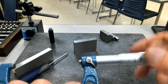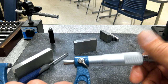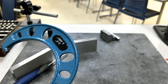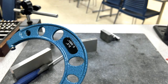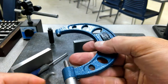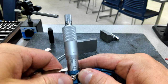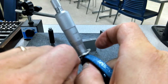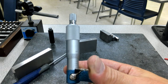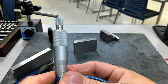Now, if I were to be consistently off by 1 to 2 thousandths of an inch, wherever I happen to be in my range of travel, so if I measure it with the standard and it's 2 inches, 1 thou, I go out to the end of my travel and I get 3 inches, 1 thou, I've got this hole back here. What it allows me to do is make some adjustments, but that is an adjustment that follows through everywhere. Ours was good at 2 inches at the beginning, and that standard fit good. At 3 inches, it was off a couple of ten-thousandths. So we have the ability to just rotate this if our reading is consistent. If I was consistently off by 1 to 2 thousandths of an inch, I can make that adjustment here with this tool, because this sleeve is just on there. It's not threading on tighter or looser, it's just rolling around there.